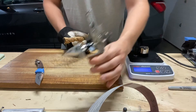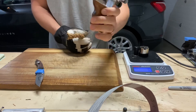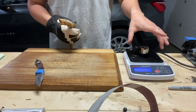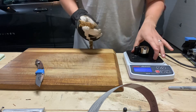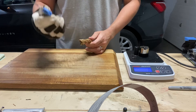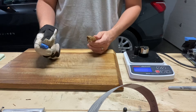The purpose was to match the sharpening done on the KME. I did three sharpenings on the KME that roughly matched that progression. Then I tested the final sharpness after sharpening on the BESS tester. The average for the WorkSharp sharpening I just did is 120 grams.